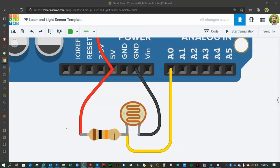Let's examine the light sensor voltage divider circuit in Tinkercad. Notice the input voltage of the circuit is 5 volts, taken from the Arduino's power pin. And this is connected to one end of the fixed resistor. In the real world, it is impossible to plug two wires into one port, which is one reason why we will employ the sensor shield for this project. Fortunately, we are not so limited in the virtual world. Notice the circuit is completed with the black wire connecting the photoresistor to one of the ground pins on the microcontroller.